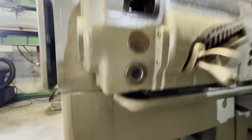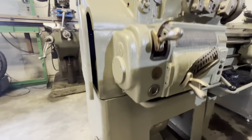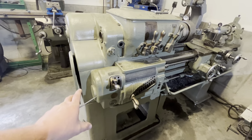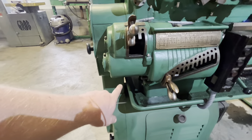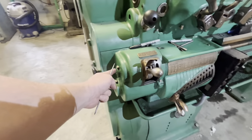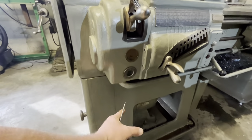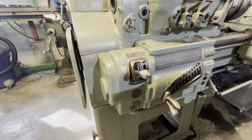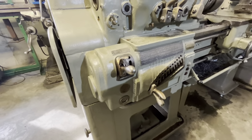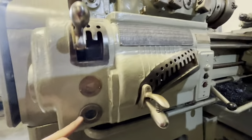The quick change mechanism fills through just the cavity right here. If yours is not an 18-speed, it will not have this reservoir — I have an example of a 12-speed right here that does not have it. The 12-speed is all manually lubricated; the 18-speed is pressure lubricated. If you remove that pump, there will be a fine screen mesh filter around it that can sometimes get restricted.